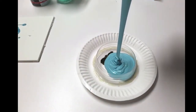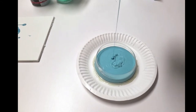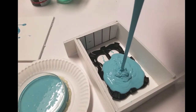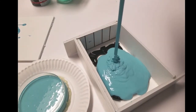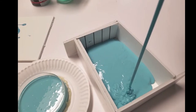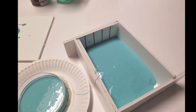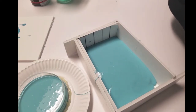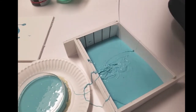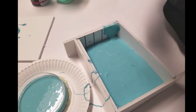A tip: the higher up you go with your pour, it helps pop the bubbles within the material. This material does not need to be degassed, so by pouring from higher up you can eliminate a good majority of the bubbles. Make sure you scrape out that cup and get all that material — rubber is not cheap. I really wanted to make sure I had a thick enough base so the buckle wouldn't warp when it was inside the mold. And just like that, that's how you make mold boxes — quick and dirty.